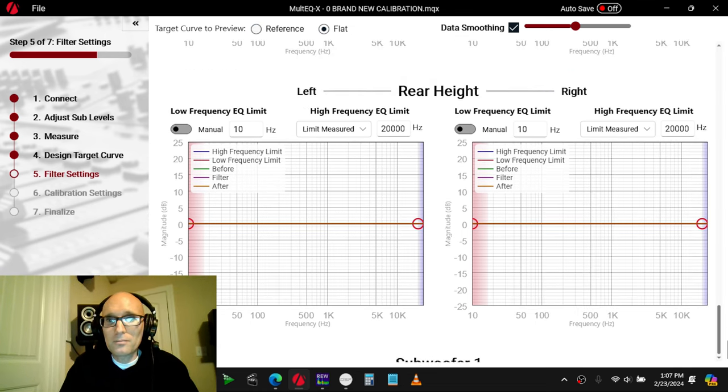And now we'll measure again. I'm going to keep the screen here because I'm going to normalize this every single time. I need to know that I'm getting exactly the same performance as the subs measured originally, right? Because anything else, you're out of bounds. You're going to push your subs too hard. And when you push subs too hard, that signal does not belong there in your subs, it doesn't sound good, right? I'm doing this to make my subs sound as good as they can. There is a point where, look, $1,600 subs, we can only do so much, right?